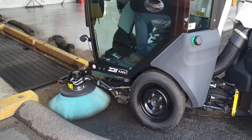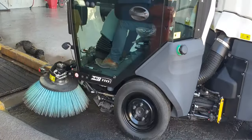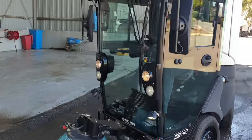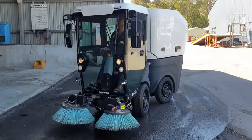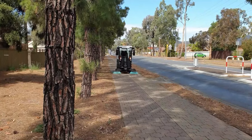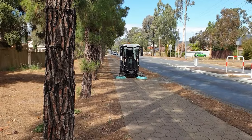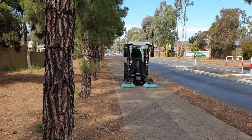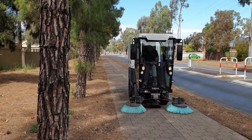The MC110 is designed for today with tomorrow in mind. It has three defined working speeds that handle the different sweeping tasks which the operator encounters daily: an eco mode, a standard mode and a boost mode limited to 10 minutes of use. 80% of common sweeping tasks are handled with eco mode — preferring to use this working mode gives you up to 50% fuel savings, less noise pollution and preserves the lifetime of your sweeper. The MC110 can negotiate narrow streets with great agility as well as footpaths. Articulated and with a tiny 1.8 metre approximate turning radius, it can virtually turn on the spot and with a height of less than 2 metres it's the ideal sweeper for underground car parks too.